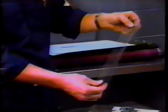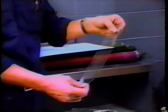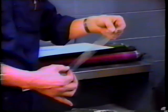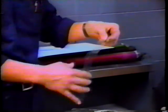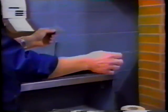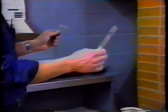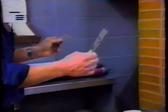Next we have a plastic strip, and if you can see this, it's also used for the strip method of roller setting, also 4 to 5 thousandths of an inch thick. We would use them two at a time, put one on one side of the roller, inch it in, one on the other side of the roller, inch it into the press, and get a feel by hand. Someplace to start. Not a real accurate method of roller setting, but it is a good place to start.